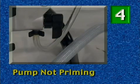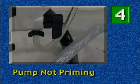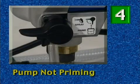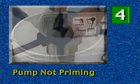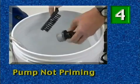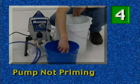The pump not priming can also be a common issue for new users of airless spray equipment. Generally, one of the following things has happened. The spray prime valve is at the spray position and it should be at the prime position. Or the inlet screen is clogged with dry paint or debris and needs to be cleaned. Or the suction tube is not immersed into the paint.